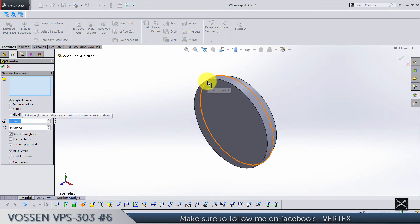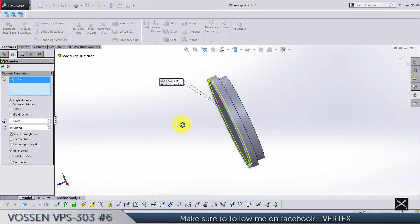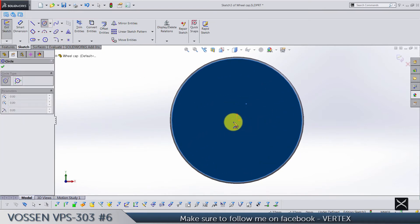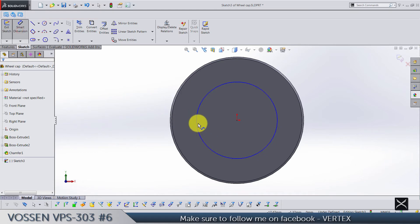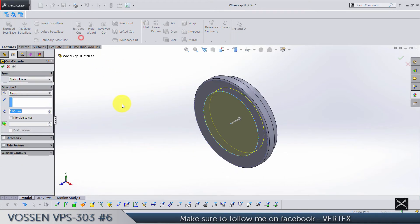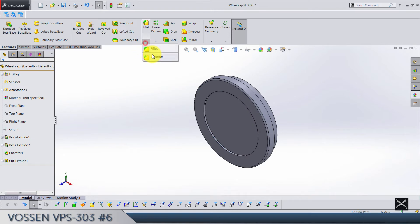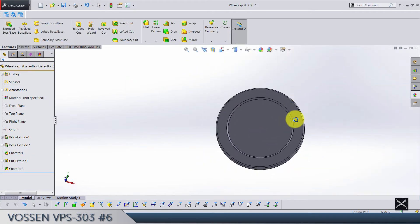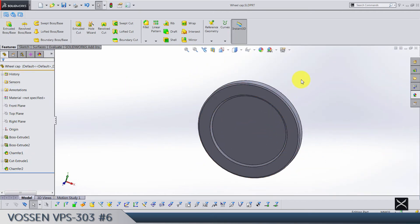It's actually going to be 0.75. Here we need one sketch — cut diameter of 43.5 by 1, and here we need a chamfer of 1 by 45 degrees.